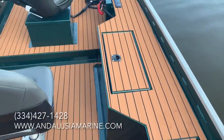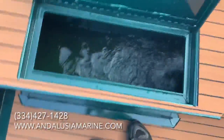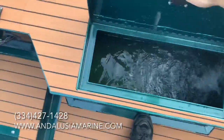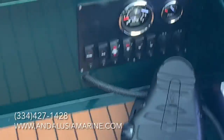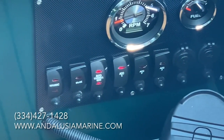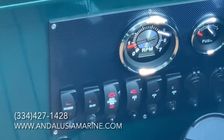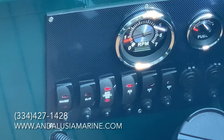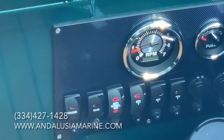On the Ultimate it actually comes with the live well timer. If you note on the switch panel, you can flip it down to manual and it's going to run all the time. Flip it up to auto and it's going to run for a minute, then cycle off for a period — I believe it's two minutes that it's off — and then it'll cycle back on.